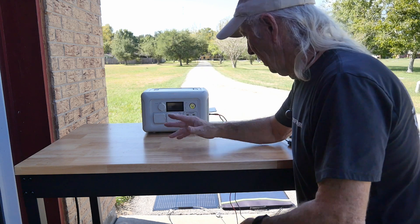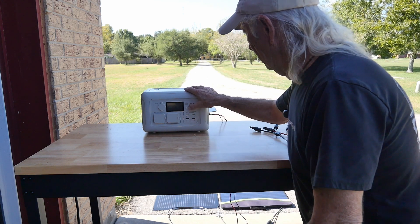For small systems, this is the sort of thing you might want to think about. Since coming back inside, it's dropped to 30 minutes — basically cut the time in half. All I've done is change the wiring layout to series, running 24 volts off a pair of 100-watt panels. I've cut my recharge time in half. I've had a lot of people contact me who don't understand — they want to lean on that 12-volt setup. But if you can go higher voltage, I would go higher. Higher voltages help the system work faster and better, keeps the wires cooler, the whole nine yards.